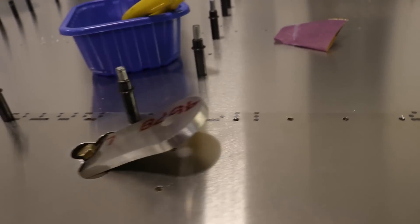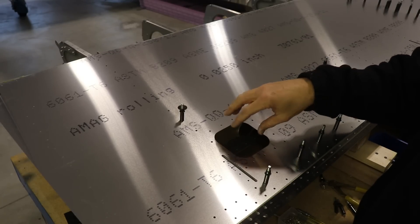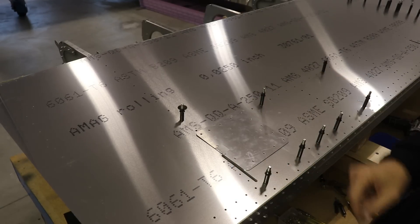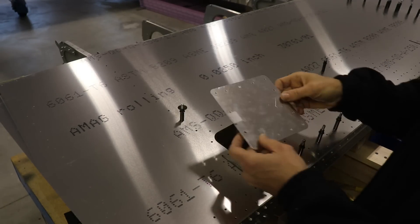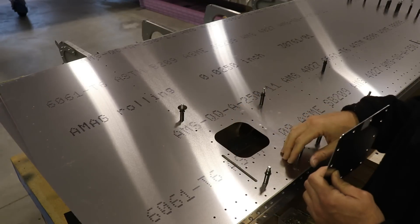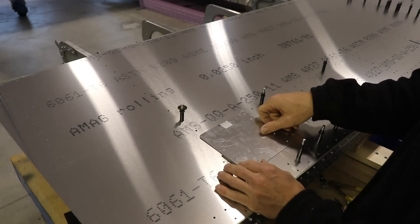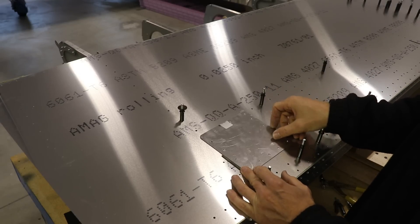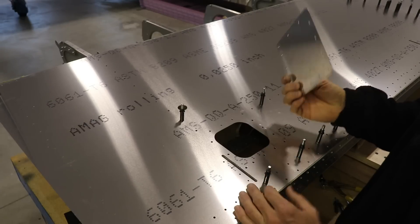To get to this rivet right here on the bottom side of the wing, right behind the fuel tank, we have a nice big opening to give us access to the fuel lines. We also have an access cover that goes on here that is meant to get riveted in place. But when building an airplane we always want to think ahead — what happens next year when I want to inspect inside here, or what if I ever get a leak? It's not a huge deal to drill out rivets, but who wants to drill out rivets on a painted wing? So instead of riveting this on, I will use screws to attach mine.